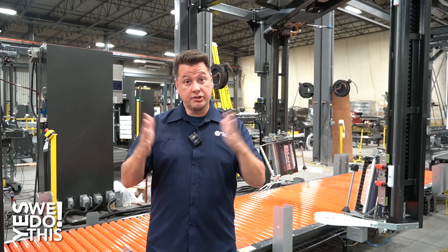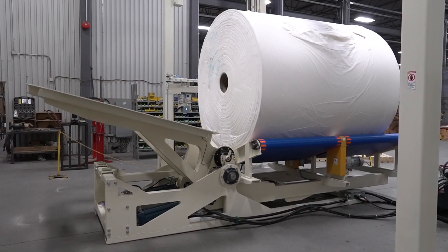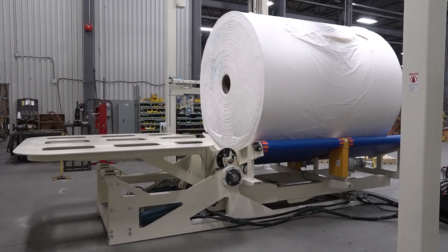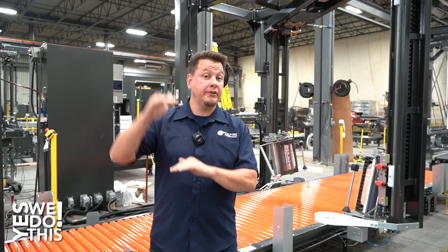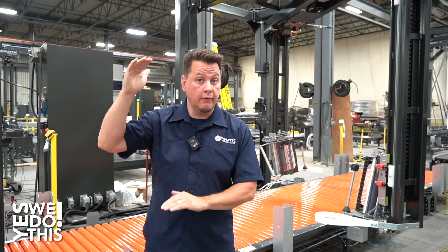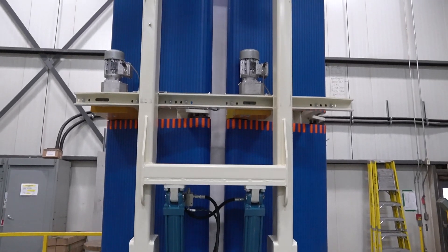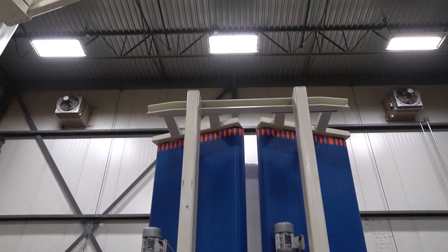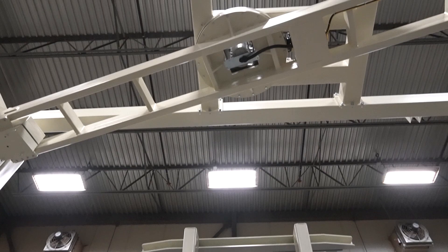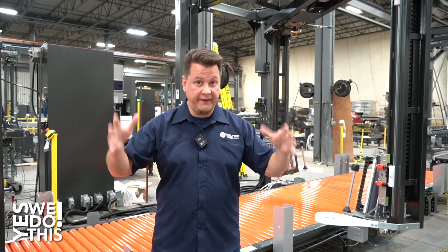This upender is double-actuated so it can lay completely flat to clear the passage of the rotary arm boom during the wrap cycle. At this point, we had to expand the machine height to a total of 225 inches tall for the upender mechanism to be clear, and the wrap diameter was expanded to 176 inches so their big paper roll would fit in.